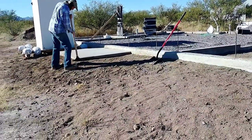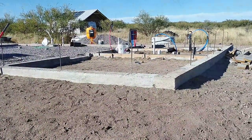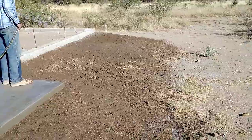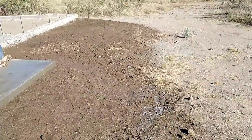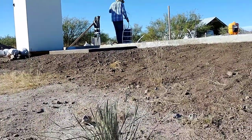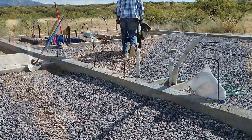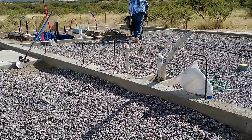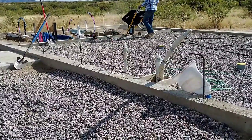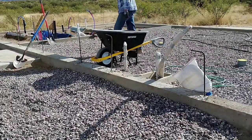I've gotten around to backfilling around the back porch — smoothing out the dirt, wetting it down, and compacting it with our little compactor so it doesn't erode over time. We built the pad up about a foot on one side and two or three feet on the other side, giving us a nice grade sloping away from the house to take water away and keep it well-drained and dry. Now I'm finishing up filling the master bedroom and bathroom area with gravel — getting that four inches of gravel in there. This is the last bit before the whole pad is covered with the gravel layer.